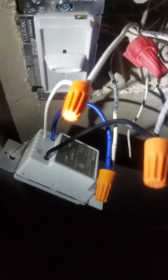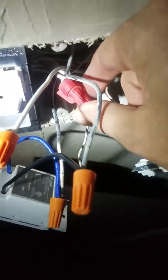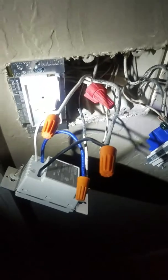That's how you can tell which wires to hook up. So there's my line, there's my load, there's my neutral — which you have to dig out of the electrical box to find — and here's ground. If I've got all that right, it should work.